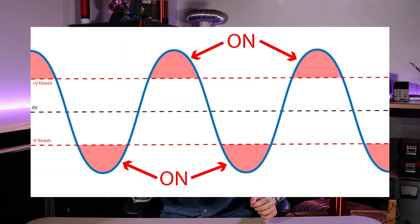So the spark gap Tesla coil is actually the original type of Tesla coil, and this is pretty close conceptually to what Tesla himself would have built. As inefficient and loud as spark gaps are, back in the 1890s when Tesla was first building these things, this was the best technology available to make a voltage-controlled switch. Vacuum tube oscillators weren't invented until the 19-teens. The way this circuit works is actually really simple. The spark gap triggers twice every mains cycle when the voltage from the neon sign transformer exceeds the breakdown voltage determined by the distance between the electrodes.